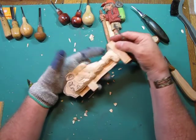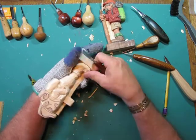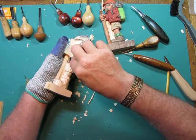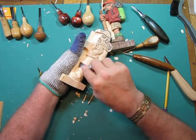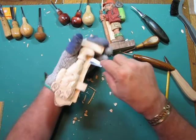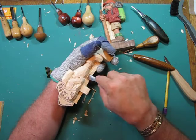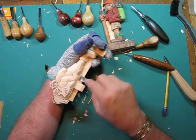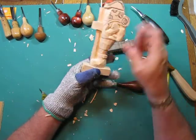See how we removed some of that wood there? I can go back and get more done, continue to take off more. I want to do some shaping to the head and face, so I'm just going to worry about this area down here in terms of getting a little bit more depth between the body and the stick. I just want some more separation down there. I like using this fishtail gouge because it's a fairly sturdy, short blade that can get in there and show that depth between the stick and that area.